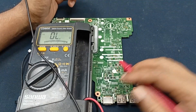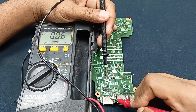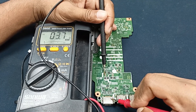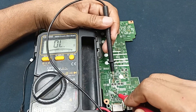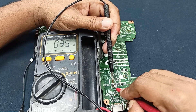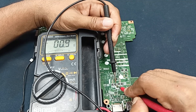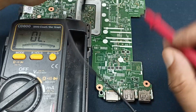In this region, you just hold the positive lead to ground and check. Here is 0.5 ohms — it's swing. This side is showing 3.7 ohms. Now check this MOSFET — here is a swing, 3.3 ohms. And this MOSFET here is 0.8 ohms — maybe this MOSFET is shorted. Let's open this.